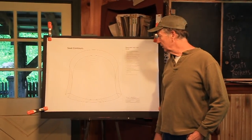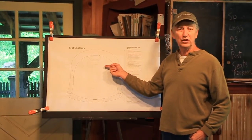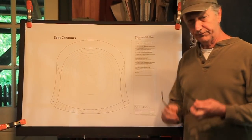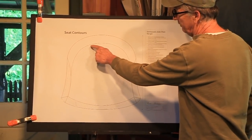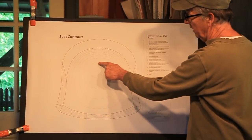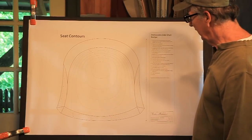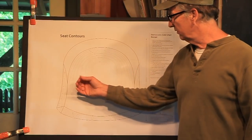In this video I'm going to show you how I carved the seat. Here's the seat contour I have drawn. Zeroes up here and we're dropping down in eighth-inch increments to where we go pretty close to an inch — that's the seven-eighths ring right there, so 15/16ths to an inch something like that. I'm going to do it all just with a scorp on the concave part.